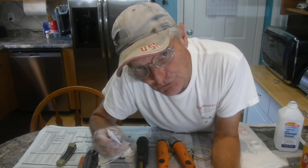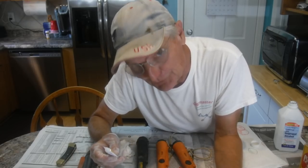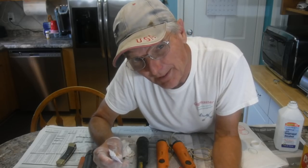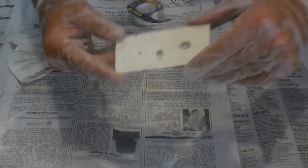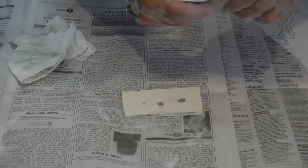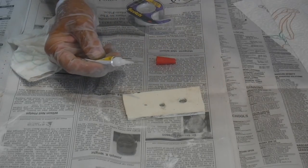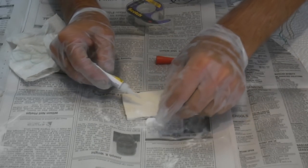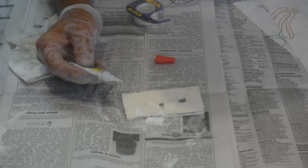That's not the only thing you can use this for. If y'all want to hang around just a couple more minutes, I'm going to show you some other uses for cyanoacrylic super glue - it's called cyanoacrylic adhesive - and the baking soda to repair other things around the house. Alright, let's say you've got something with holes in it - y'all can see there are holes in it right there. The first one is just an open hole. We're going to see if we can repair it. First thing we're going to do is put a little crazy glue around it, take a little baking soda, put it on it, and a small hole you can do this with. A bigger hole you might do a little something different.